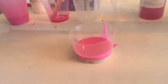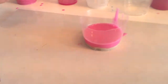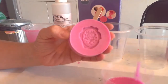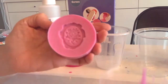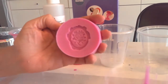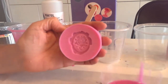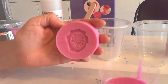In 20-30 minutes at room temperature — which is 24 degrees Celsius — the mould will set, and you'll have a silicone mould ready to accept resin. Ideally, leave the silicone rubber mould overnight to fully cure and get the maximum number of pours out of it. But if you're restricted on time, you could pour straight into the mould an hour or two later for just one or two pieces.